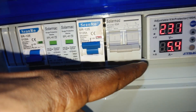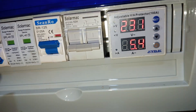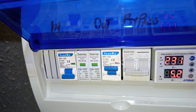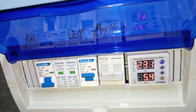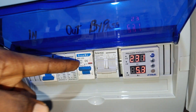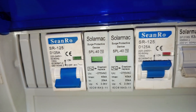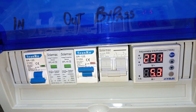This one shows the load at this point. Just one AC is currently on and it's drawing 5.17 amps — this is the surge for the AC. Since this breaker is off, this is a completely hybrid system. We just have 6 ACs this system is powering. The other two batteries are on that location. Since we are going completely off-grid, we dropped the input and are using the energy from the generator to charge the battery and also power the load in the house.